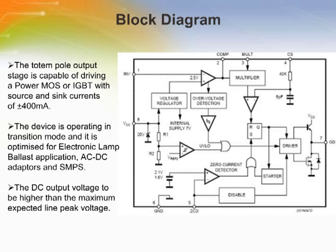The undervoltage lockout comparator with hysteresis is used to enable the chip as long as the VCC voltage is high enough to ensure a reliable operation. The error amplifier inverting input, through an external divider connected to the output bus, compares the boosted output DC voltage, VO, with the internal reference so as to maintain the pre-regulator output DC voltage constant. A sophisticated two-level over-voltage protection is included, and a disable function is available to shut down the device.